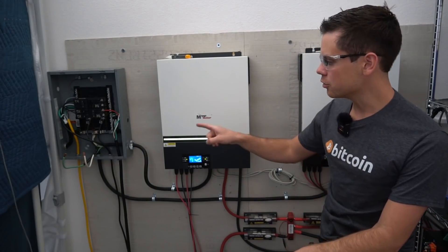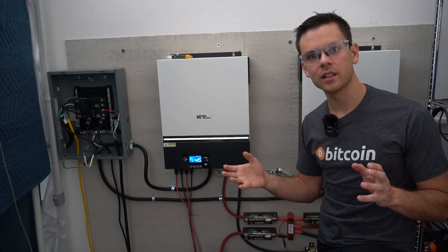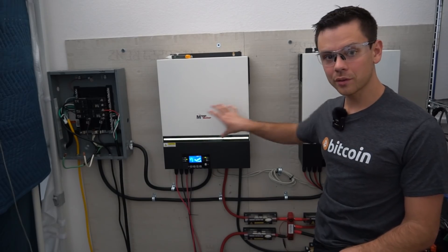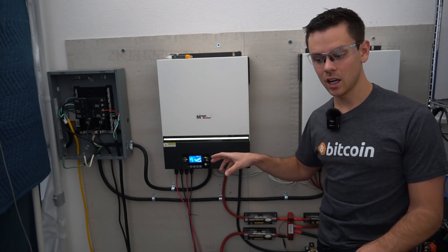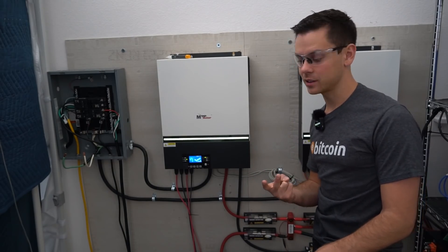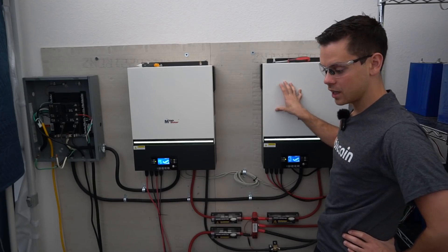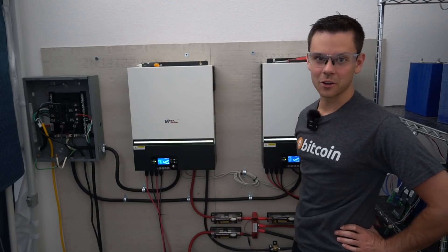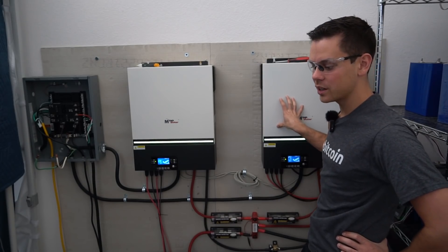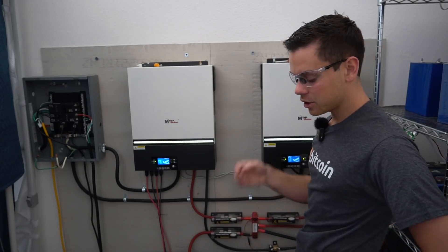Something that got me thinking is that the neutral for these inverters' AC output is not technically the same neutral you would find in the North American grid. Even though it's bonded here, you are putting two of these circuits in series, so that is considered a hot — you pretty much have four hots and two grounds. Now if we connect the grounds over there and we also have the AC input grounds connected to the grid, we've made another ground loop. So if you want to connect these to the grid, I think you should only do it with one unit. The manual states that you can connect them all, so I really don't know how to approach that — I would love to hear your thoughts.